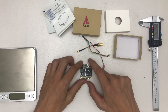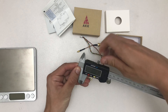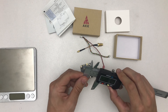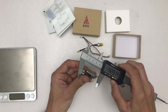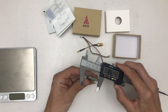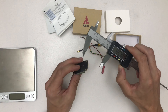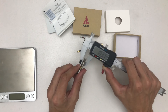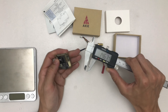We're probably running 6S and this will fit perfectly. This is the 30×30 or 30.5×30.5 mm hole spacing that most flight controllers use — let's just confirm that. So we have 30.5 mm on that axis. With the connector it measures 37.23 mm, and without the connector it's 36 mm on both sides. The tallest part is the connector at 5.95 mm, and the RF shield is pretty much five millimeters tall.